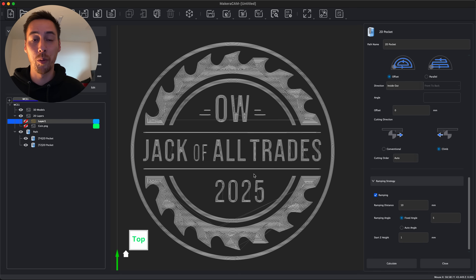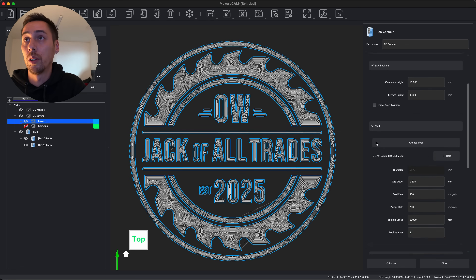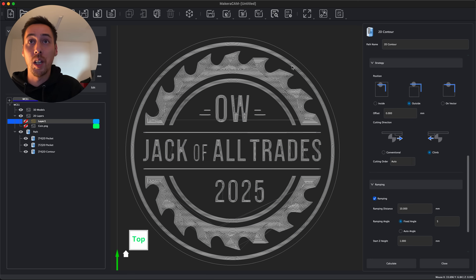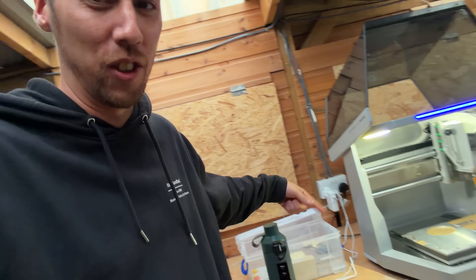So highlighting the image again and creating another 2D pocket path, we change the tool to the 0.2mm engraving tool, calculate that, and straight away we're getting much better detail. I really want the 0.1mm tool to get that extra detail - it would include the shapes out of the letter 'A' that I got on the first pass - however I don't have that tool. The final thing is to cut out the actual shape: 2D path contour, set depth to 5.5mm since that's our material depth, change the tool to 3.175mm, and this time we don't need to change the offset because the stroke is included in the engraving, so we keep it at zero. Calculate that and we have our paths. We export that and send it to the machine. To save on material I've just flipped and rotated the aluminium plate.